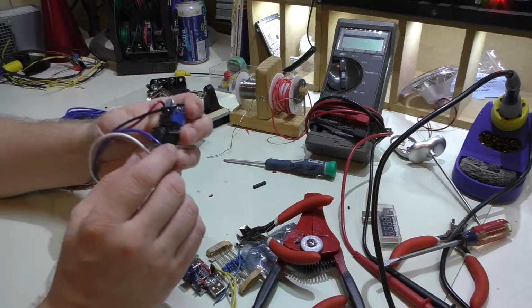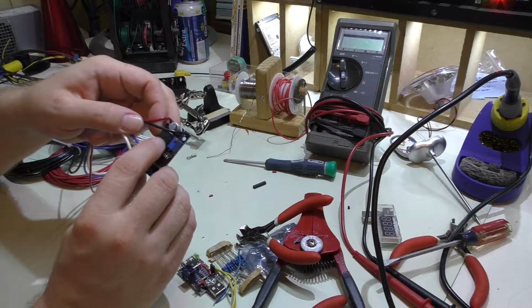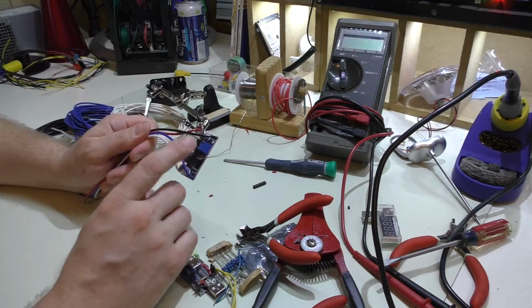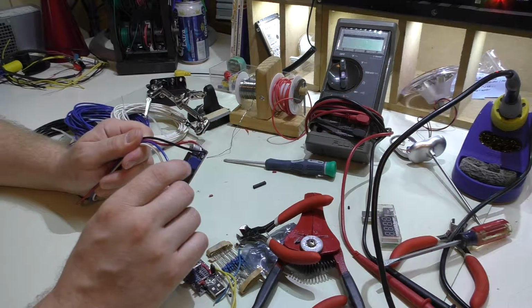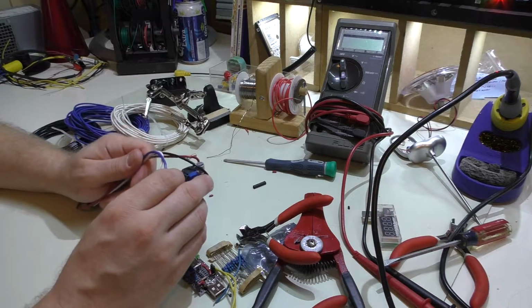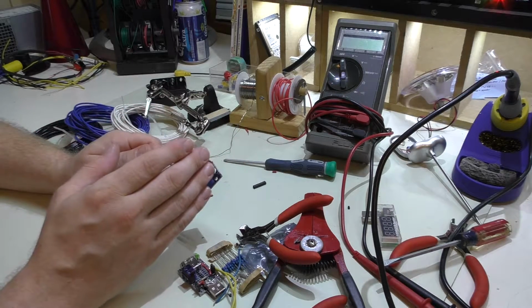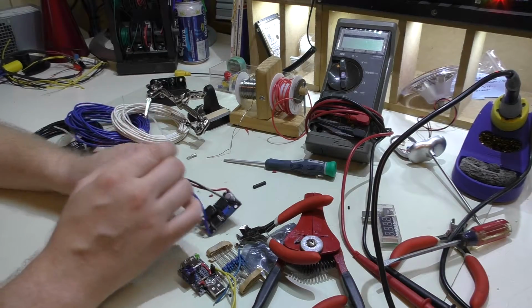And by the way, the way you can tell this is a buck boost converter is because there's actually 2 inductors, so it's using one to step up and one to step down. Now there's a good advantage to this. I need to get 5 volts out of this, and considering that the minimum is 3.8 volts, I can actually dip down below the 5 volt output and still get 5 volts out, even though I'm using a 12 volt source.